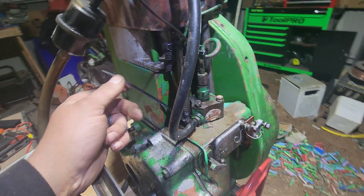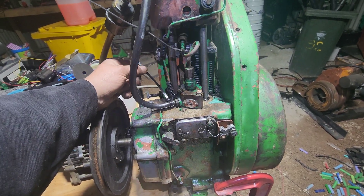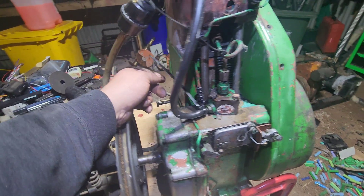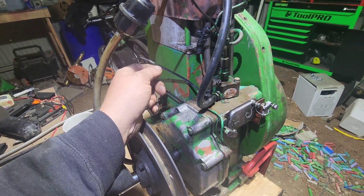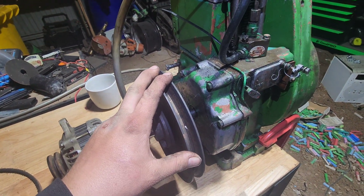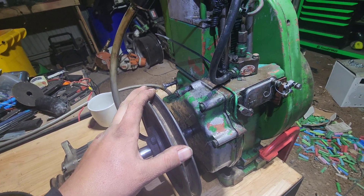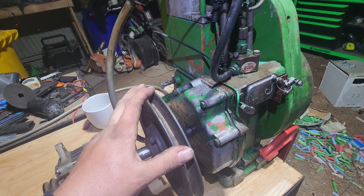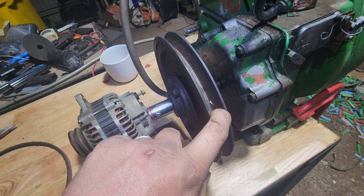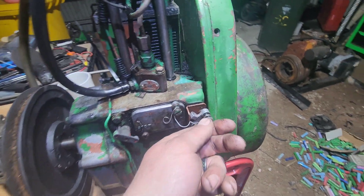That's the heat shield that dad's one is missing — we'll manufacture something similar. This is an air-cooled engine, no radiator or cooling system, very simple. These were made circa somewhere in the 1970s, though the Lister engine design is from much earlier — they've been around forever. This one was on an Ajax pump, which is a reciprocating piston pump, very low RPM. It's got a multi-V belt here which allows you to use either an A-series or a B-series belt.